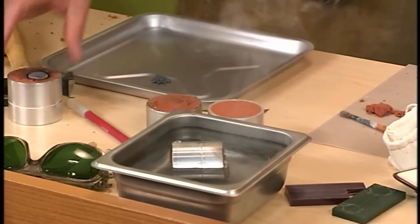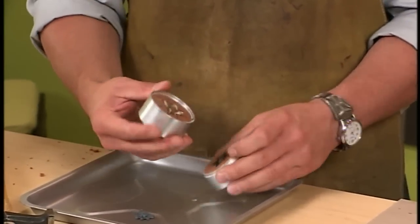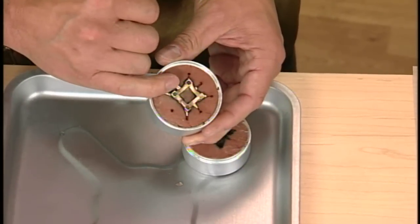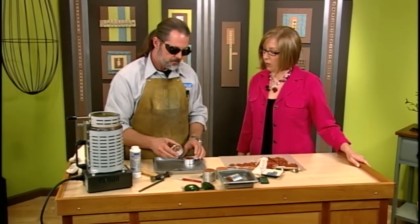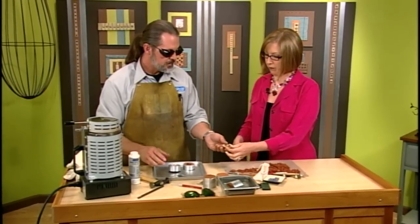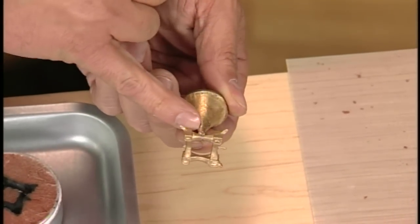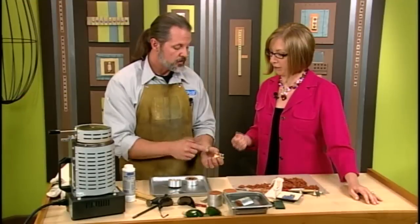And what's really neat is when you're done, you can just pull it apart and there's your casting. That is amazing. You push it out and break it out. And you can reuse all this sand, except what's black — whatever's black, you flake away and reuse everything else. You'd chop it up with your blade again. When you take it out, it looks like this. After cleaning and brushing with a toothbrush, you'll take your jeweler's saw, cut off the big sprue, and you can reuse all this metal — you'll just melt it down again in your furnace or with a torch.